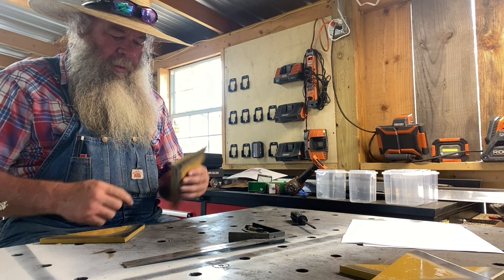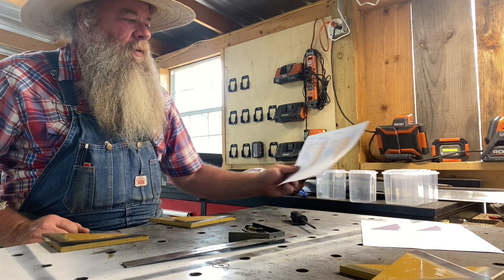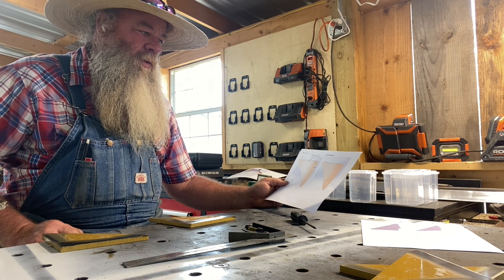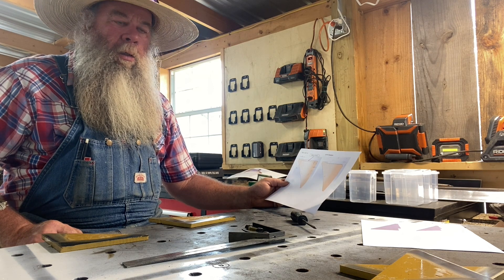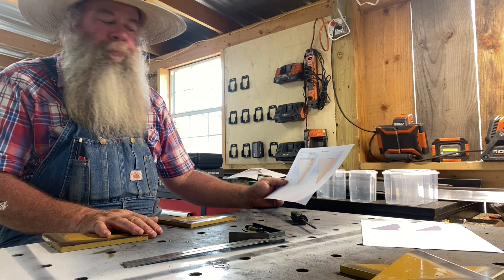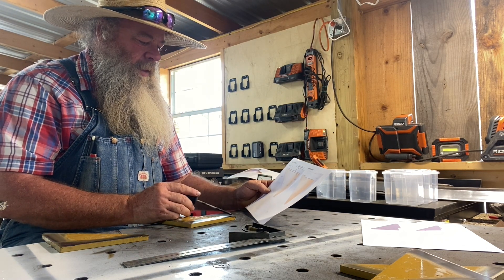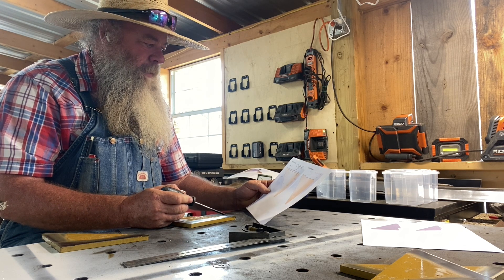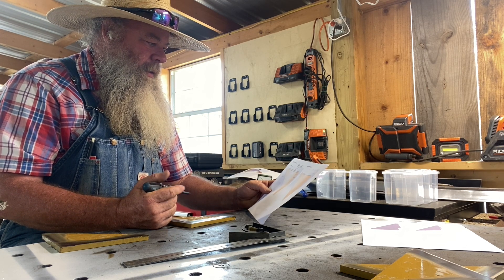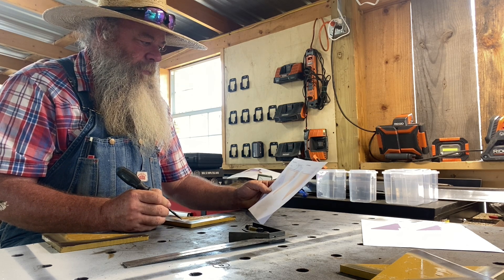I went ahead and just ground off some of this paint a little bit — hope it makes it a little bit easier to see. We have two sets of brackets, both cut the same as they came, but we need to make them a little bit different. So I'm going to lay this first one out. It looks like on this first one, from this end, we're going to come over an inch and three-eighths and make a mark down — that's going to be a quarter inch down. Then we'll scribe across and come three-eighths in from this side — that'll be the beginning of an angle cut coming down.